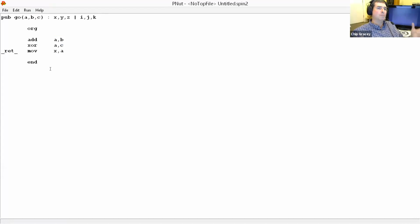And you can also write code separately that you pull in, and it doesn't have awareness of your context like with local variables, but you can have programs that start up and do something or terminate and stay resident, run on interrupts thereafter. You could load them at any point. I could put org here. Let's say I want this to come in at 100. I could do that. And so it wouldn't even bother what's in the beginning of memory.